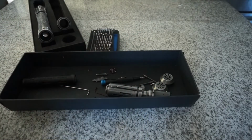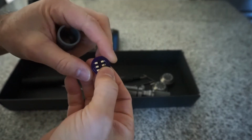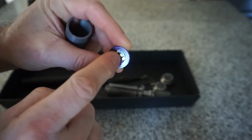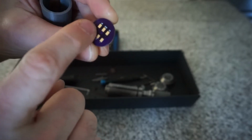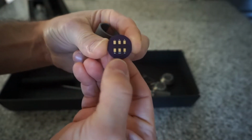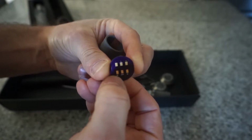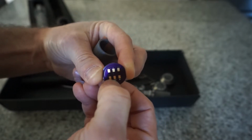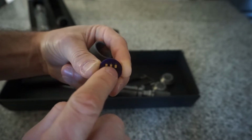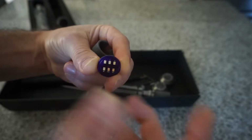But what I wanted to show you here was the PCB, right? You get 3 pads for your buttons, so you get common ground. Button 1 on the right says B1, button 2 on the left is B2, and then switch ground, which is just common. So you can wire there, and then you have your pixel pads on top. You have 1 data pad, positive, and then negative.